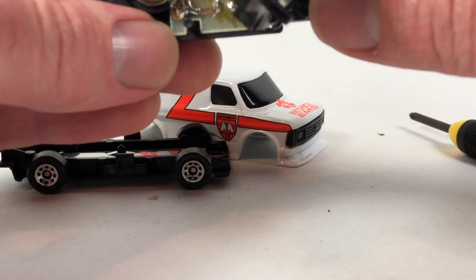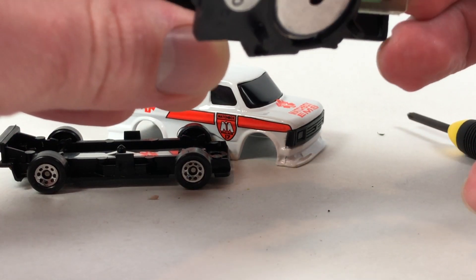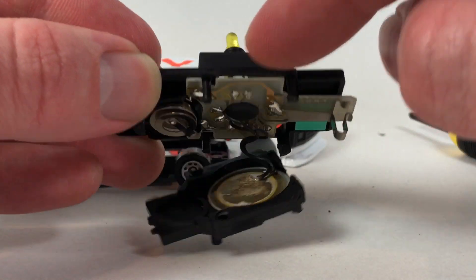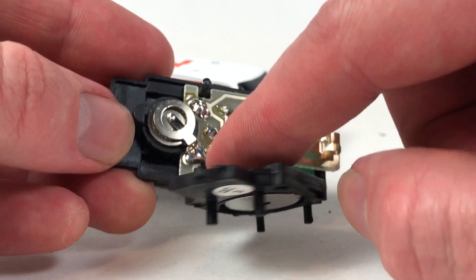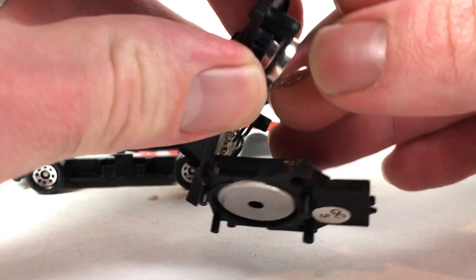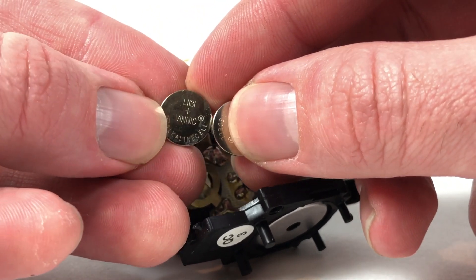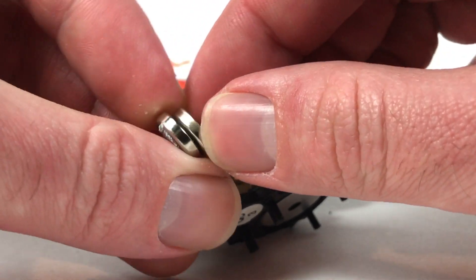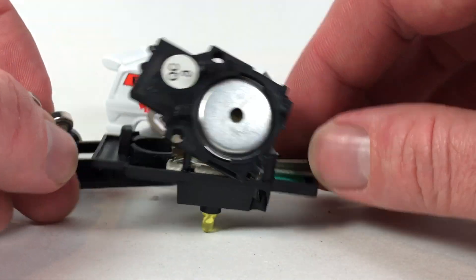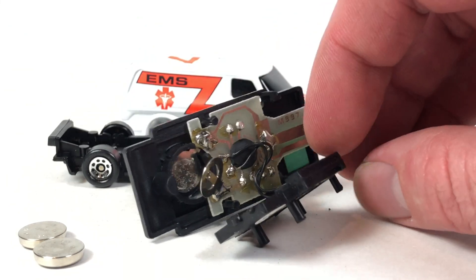I think we may have to pull this whole unit out of the plastic. I want to do it carefully because I do not want to break anything. We can't just pull it straight out because the LEDs are soldered right here, down onto the board. So basically it's this thing right here that's stopping the battery from coming out. Maybe what we can do is just bend it up a bit so that the battery falls out. And it's two batteries — it is two batteries. These are L1131s, which I believe cross-references to a 389 battery. I don't think I've got one. I've got a 357. You can see it's pretty corroded in there.